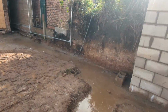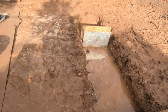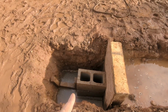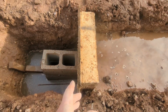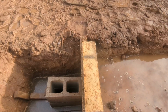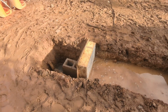As you saw from the montage footage, Mindy came and put the concrete in for us. There's about 18 cube in there, so it's 2 full loads. But we could only do just over half of the footing for the extension. The reason being, there's still a dispute that way, so we're not allowed to dig within 3 metres of the boundary, which is roughly around there. We've got some rebar shoved through, the same length in that concrete there, so when you pull that away, it will all be tied in as and when. I think there's 6 lengths in there, so it should be enough, hopefully.